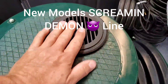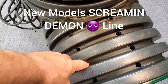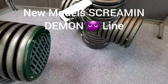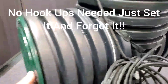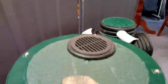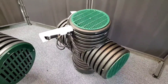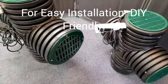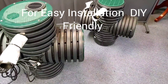The full frame does give you a sump viewer and a lot more inlet — we've got these half-inch inlets throughout the housing. That really, really makes a difference. The pump is going to have a hard time keeping up with the water that's going to be flooding into these. It's really going to be difficult for the pump to ever run dry — the float will just turn it off. These are new systems that I absolutely love. We've been putting them in and refining them for you guys.